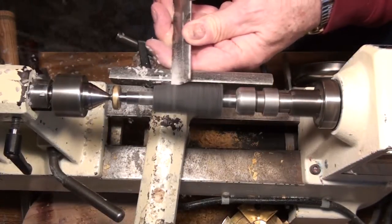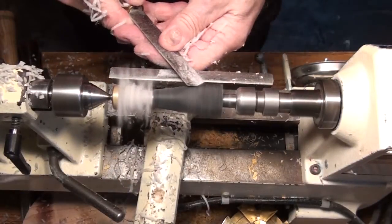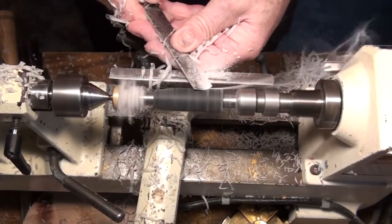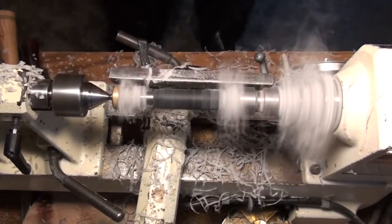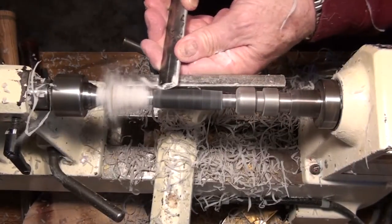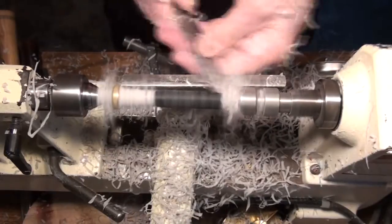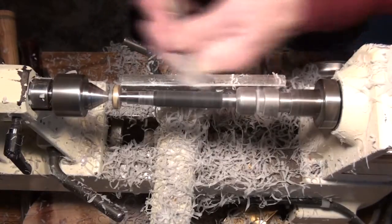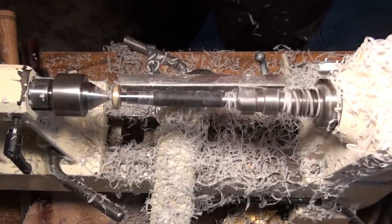Once the blank is drilled, it's just a matter of turning it, and like most resins, this is easy to turn from both ends. I turn the two ends off and then go in and turn the middle down — that's the way I typically do most resins. This particular material is made of alumalite. There was some confusion early on as to whether it was actually alumalite or alumalite-like, but it is an alumalite blank. Those of you who have turned alumalite products understand that this is very, very simple to turn. It comes off in ribbons and virtually anybody can make a pen out of it. As you can see, it's coming off in one long ribbon when I turn it. This is double speed.